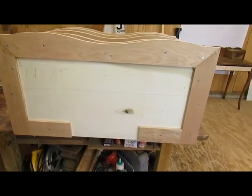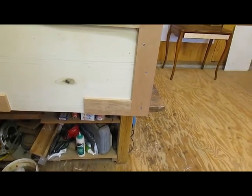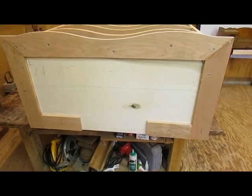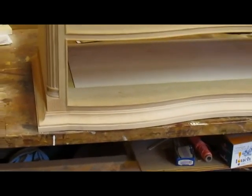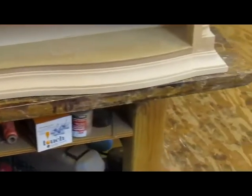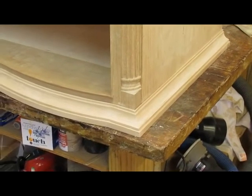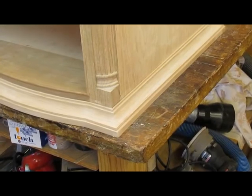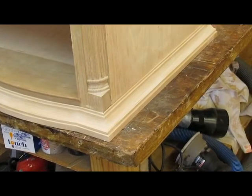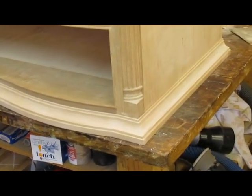There it is. I've got the returns on the back for the bracket feet, and there's a floating tenon in here which will allow that back piece to move. We're done with this piece of molding — I've got to set it upright and then add the curved molding. The molding is on and it came out pretty good. I spent some time mitering it in the corners and fitting it. It's nailed and glued in the front — about the first six to eight inches is glued in the front — and it's just nailed in the back, so we're not trapping the molding or the side with the molding. We're done with the molding, so the next thing to do is to work on the bracket feet.